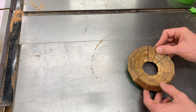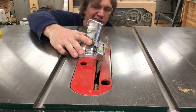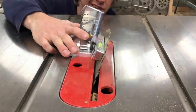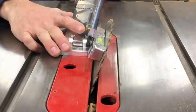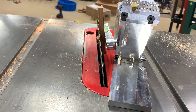Nope. Failed. So why didn't this work? Let's take another look at the angle setting with the unmodified tool. The vertical reference face is small, and that's what was bothering me and that I corrected for, but the horizontal face is also important because it controls the rotation of the tool against the table. The add-on that I made reduced this almost entirely, and I wasn't paying attention to that.